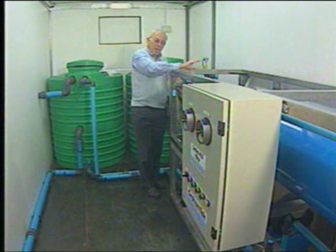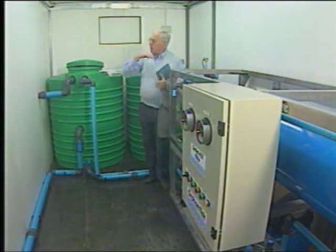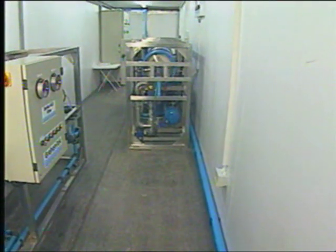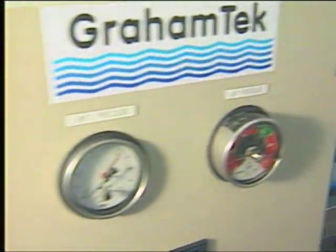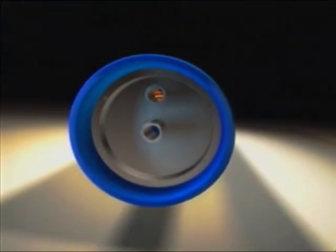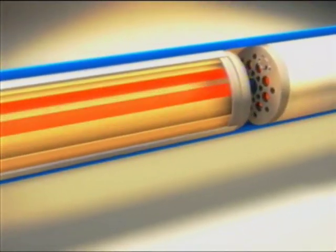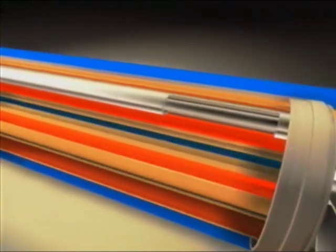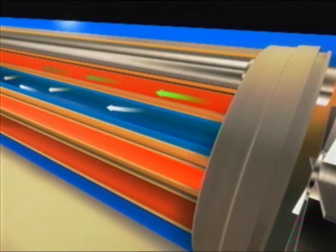The feed then enters the microfiltration unit, and the filtered water flows round and feeds the Series 403 RO desalination unit. This unit has two spirally wound 15-inch membrane elements in series, incorporated within the high-pressure vessel, and no pre-filtration chambers. The raw feed water is forced through the first flow distributor at pressures ranging from 58 to 64 bar, depending on the feed salinity.